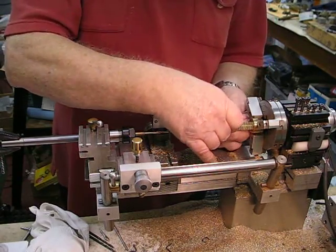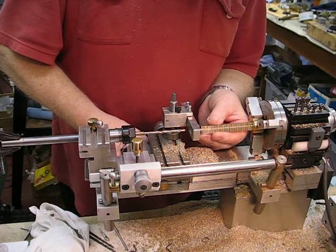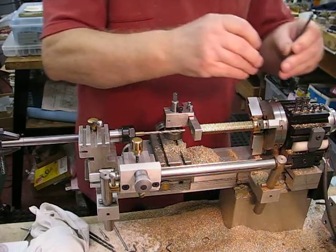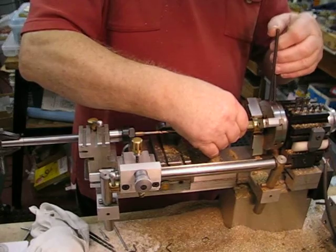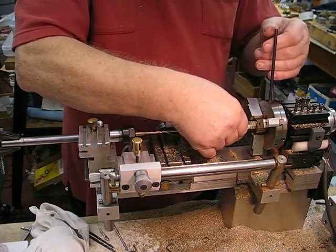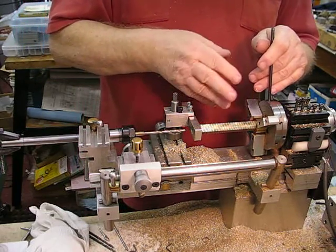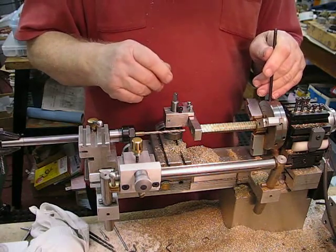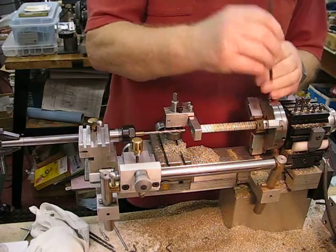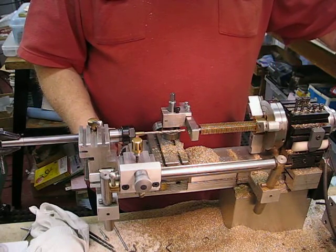I'm going to put that in there and bring the ball bearing up. There's not a lot of material — it's a very thin wall hole that's going to be produced, because when I parted in I went down to a size of 0.198 approximately, and so you've got a 0.156-inch hole going through the middle. So it's a fairly thin wall. I'll tighten that up, run it, and just see if it's running true.